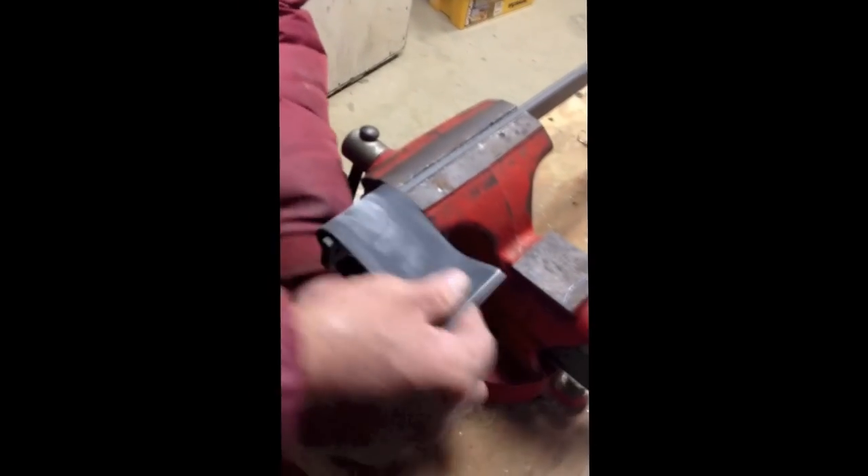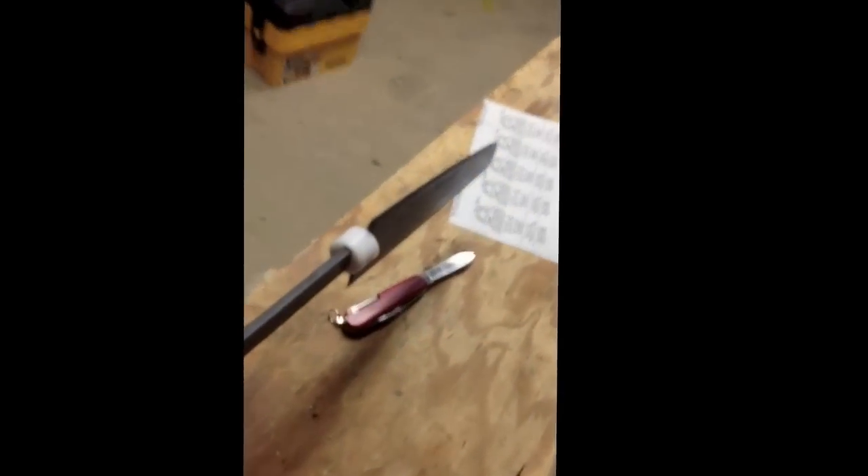You may find that it doesn't go up smoothly enough — it might be the case where the bushings aren't tight enough. So we've got the new fin put in, and it's just a little bit on the snug side. So what we're going to do is pull it out and tighten these up here a little bit. The bushings — you want to get them very, very tight. The post was a little bit tight because the bushings were just a little bit too snug on the channel that ran up through the boat. So we're just taking a little bit of emery cloth, about 320 grit, and just sanding it down a little bit, just to get a little bit of width off — not much, just enough to make it a smoother turn.